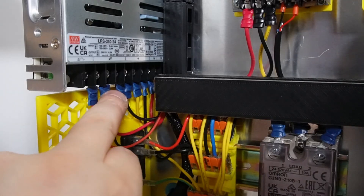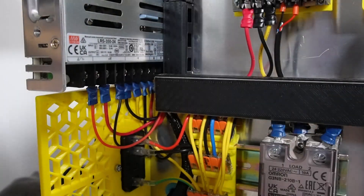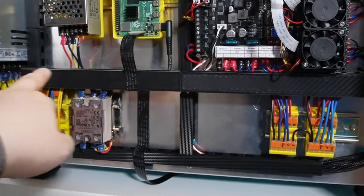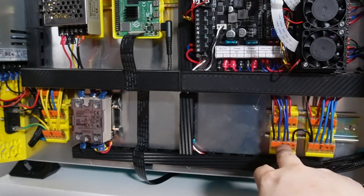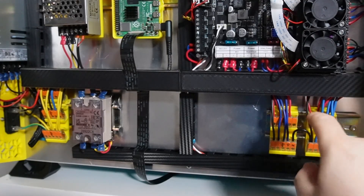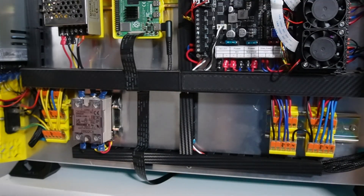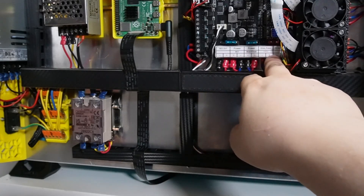That's the first loop you have to do. From here you route one cable — the plus V and minus V — all the way to the other side. I'm using five-port Wagos here as well, another one on the right side. The one on this side is 24 volts and the other is 48 volts. Two cables come in as a black wire (V minus) and red wire (V plus) to power your motherboard and everything on there.